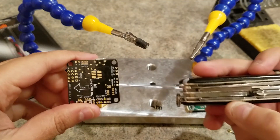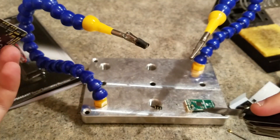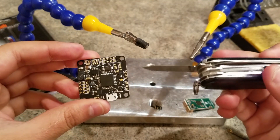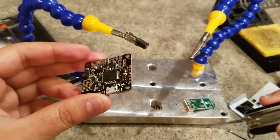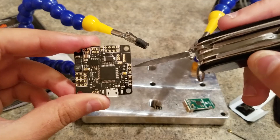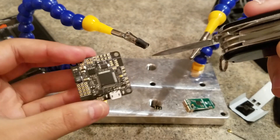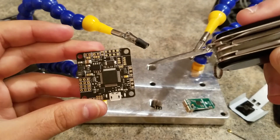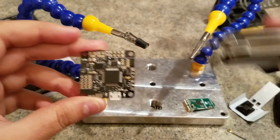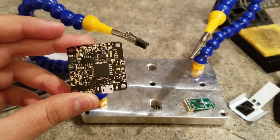The flight controller actually has a special 5 volt rail. As many of you guys know, this receiver doesn't run off 3.3 volts anymore — it runs off 5 volts, or there's a voltage range, but 5 volts is your standard voltage. This 5 volt pin will work off USB and battery power, which is something I know many people don't like about 5 volt receivers — they have to plug in the battery on a lot of flight controllers, but this will work off USB and battery.